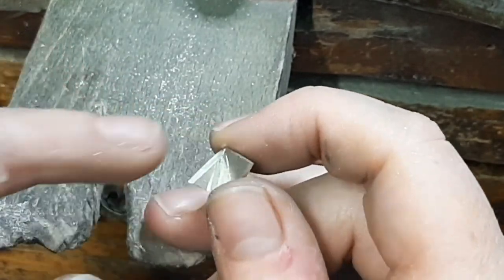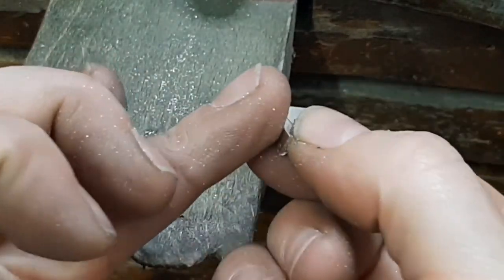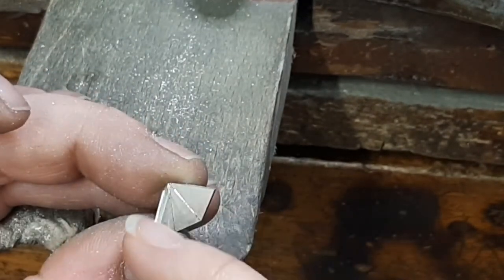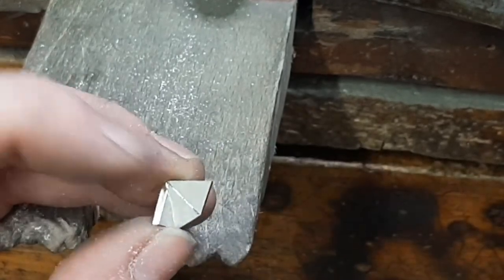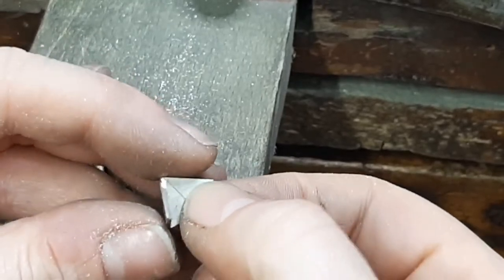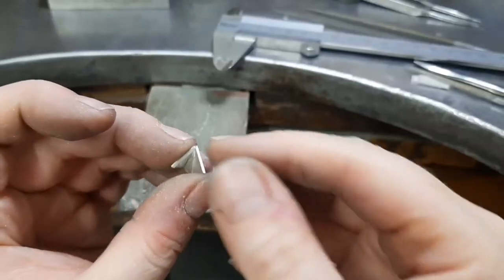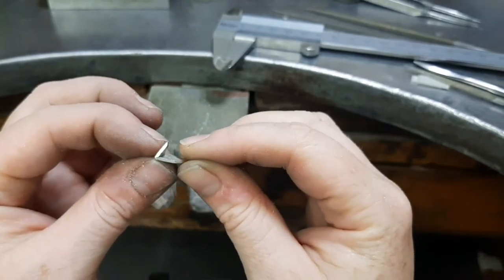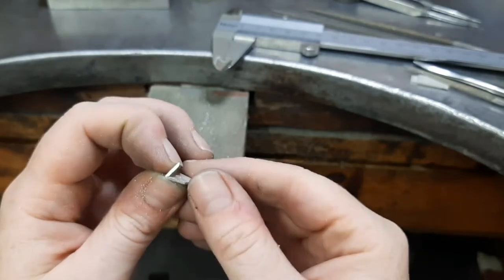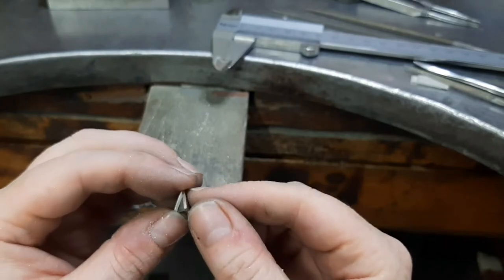I have chamfered — filed away the metal on the edge of this piece at an angle. This side is still as tall as it was before, but in this section I've filed it at an angle to allow clearance for when that other side comes in. I'm going to use my saw blade now to cut through that seam a number of times, and each time I'm going to fold it closed more until I get the right angle. The angle of this is looking really good now — you can see it's coming right in there. You can imagine this other side coming up to meet that one now. A nice triangle. I'm going to finish this off and show it to you once it's fully formed into its little triangular self.